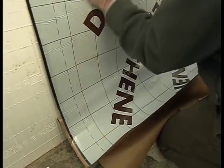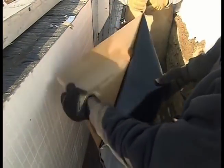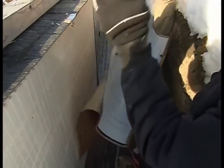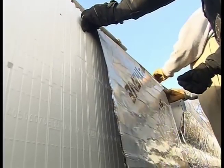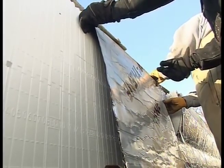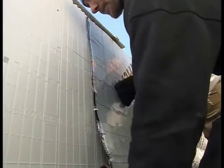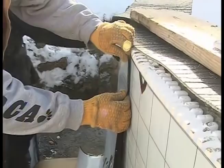It does a nice job of making the outside of this waterproof, but that's just the first line of defense. To do this, you basically peel the backing off the 40-mil product — it has a nice adhesive backing to it — and you smooth that out, starting from the middle and working your way out, just keep pulling the peel-and-stick until you get to the bottom, nice and stuck into position.